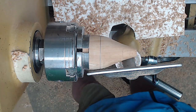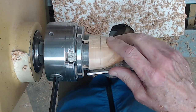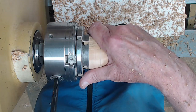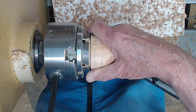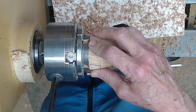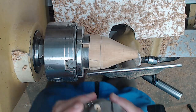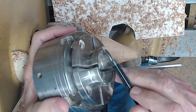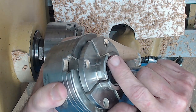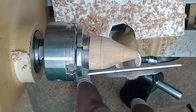Here's the trick to this thing, and it's just not really that tricky. I was amazed the first time I saw this — it's Frank Penta from North Carolina, one of the most enthusiastic woodturner demonstrators I've run across. So I'm going to go to the number one position and just cock this thing — open it up maybe an eighth of an inch. Down on the other side it's still touching, and the jaws are biting into it. This is why this particular chuck design works so well — it has what they call a micro dovetail. It actually bites into the wood.